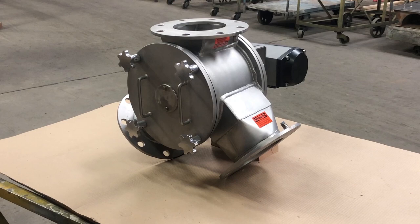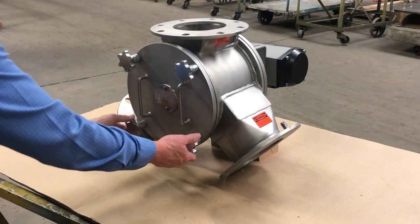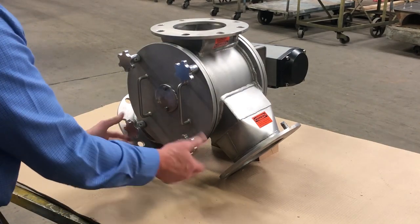The procedure to take this valve apart is simple. The actuator should be safely locked out so it cannot rotate prior to taking this valve apart. First, loosen the four hand knobs that hold the cover plate to the valve body.